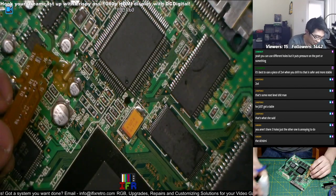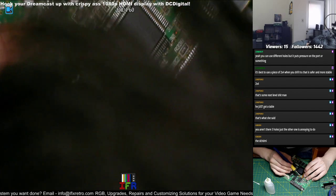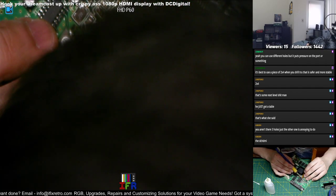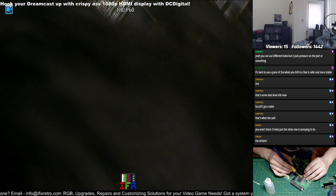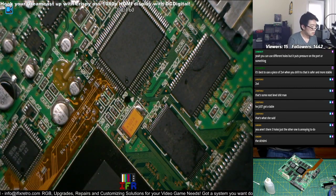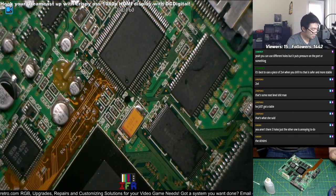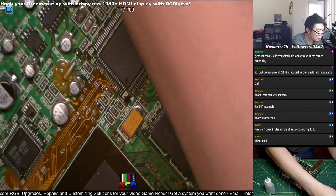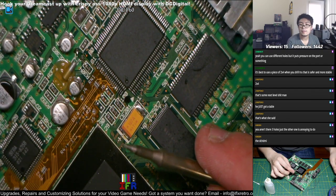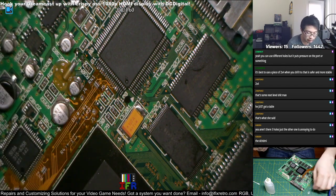Oh, it dries really quickly. Yeah, once you apply this, you gotta make sure that you solder it quickly. So it's tacked in for now. I'm not gonna fully solder it. Just wanted to align it properly. I switched tip too. I used the wrong tip. Again, you know, just use a chisel tip on it. That'll help you out for soldering. Just glide through it.